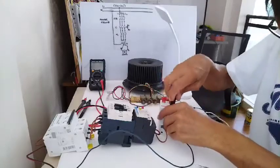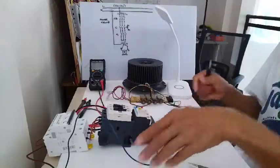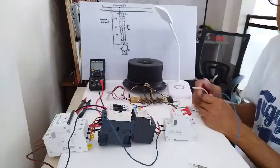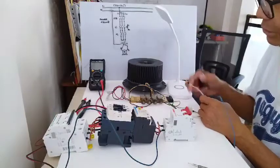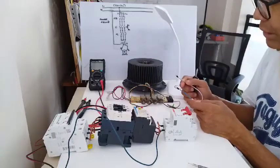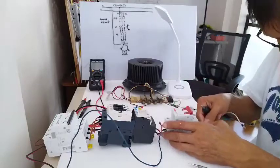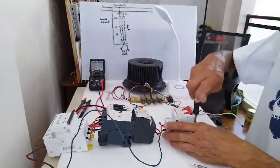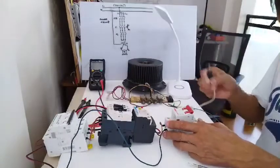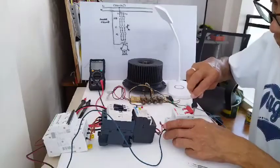It's almost done. This is my motor to be tested for this power diagram. Since this is single phase, there will be only two leads. This blue is my neutral, so likewise I'm going to insert it here — it will meet my neutral. Then the line, I will insert it here, so that will meet also my line.